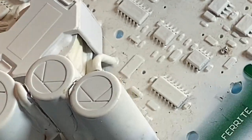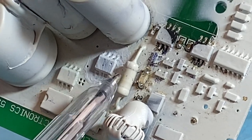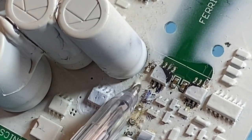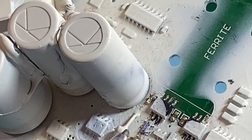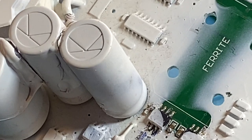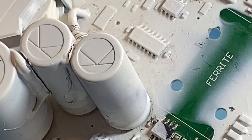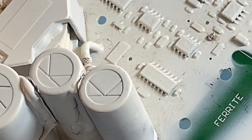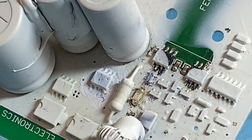My biggest gripe is the placement of that resistor there. At least you could have extended the legs and had it up in the air a little bit, or something. I just don't like it so damn close to the op amps and things, all the sensitive front end stuff. You don't want to get that hot. It's just a thing. Maybe it was a parts constraint problem.